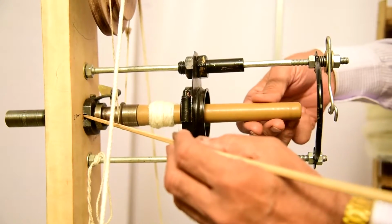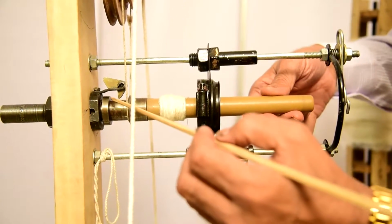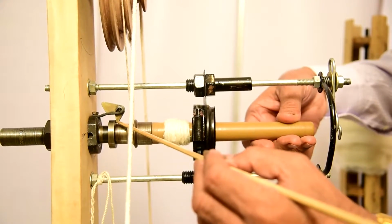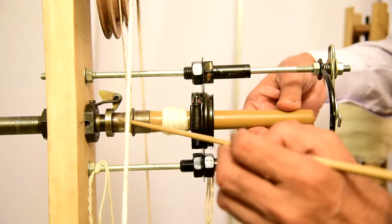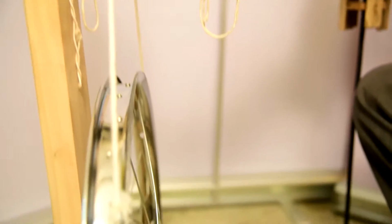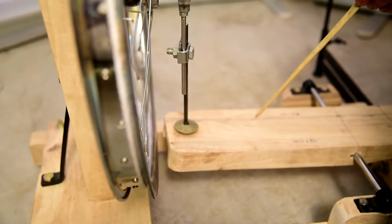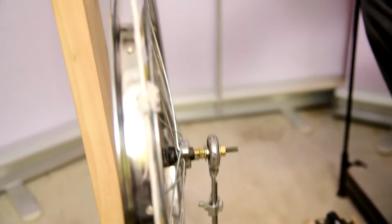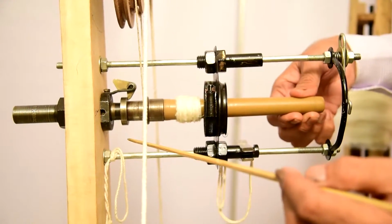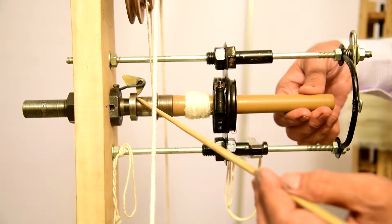During spinning, it may come out. So while it comes out, there will be a friction. There will be a friction, it gives sound, and in this condition, the treadle pressure is more. So a person has to give more energy, has to lose more energy in that case. Apart from this, if it comes out, then vibration is more. The vibration is more, that means energy requirement will be more.